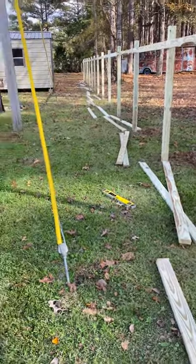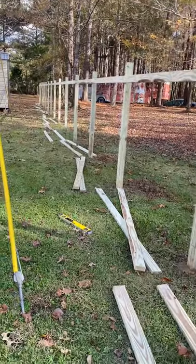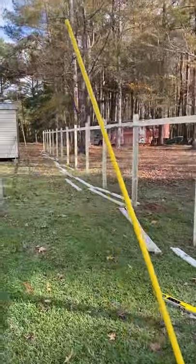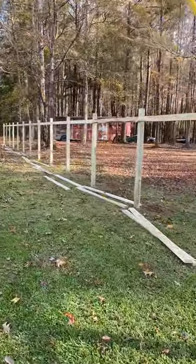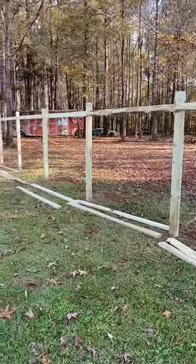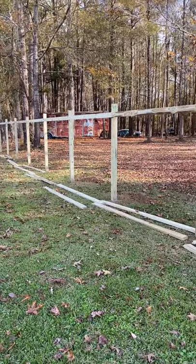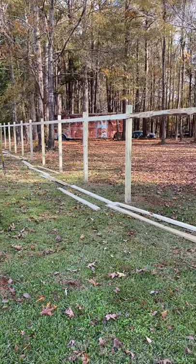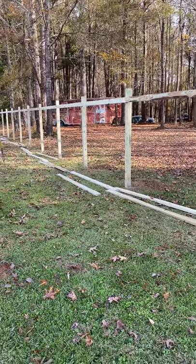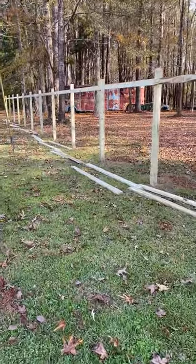Also, as you can see, I have a little bit of four-by-four left at the top — I'll just take my saw and cut that off. The reason I do that is whenever I'm adjusting my two-by-fours, I want to have the room there to adjust. Because if I went ahead and buried them all the way down to 66 inches, you're going to have some two-by-fours sticking above the four-by-four, and to me that just looks tacky. That's just why I leave that room — just wanted to give you a little insight on that.